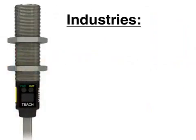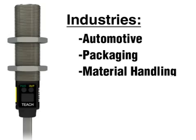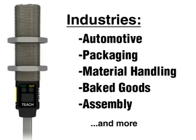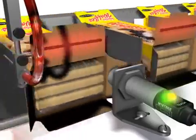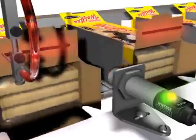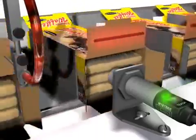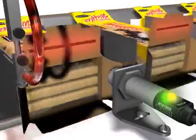The T-Gauge is suitable for many industries including automotive, packaging, material handling, baked goods, and assembly, just to name a few. In this application, the T-Gauge is inspecting that hot melt glue is present on a cardboard box and is the correct temperature. As long as the minimum temperature shift is greater than 3 degrees C between the ambient and the hot glue, the sensor can detect it.